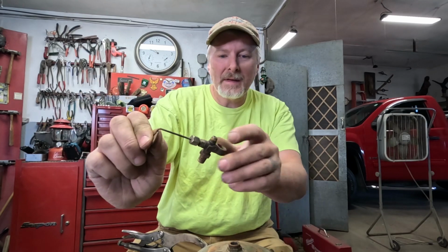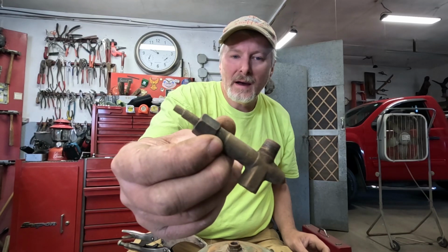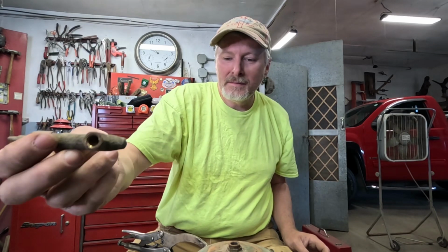That's pretty much all tore down. I could take the tip cleaner lever out and drop that little eccentric block out of there, and I could take the valve stem out of here, but there's no need to take those apart. I can spray carb cleaner through it with those together. So I'm going to get this fount out of here, bring this one over and blow it apart just like I did this one, so we got all of them all in pieces spread out here.